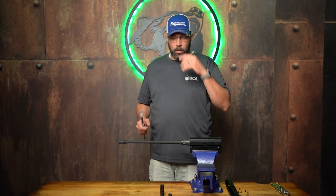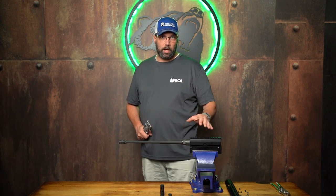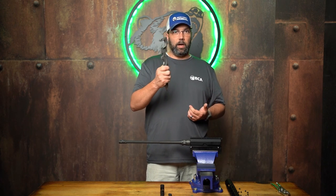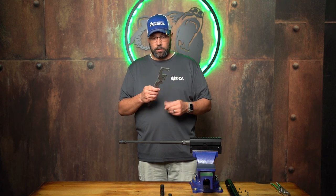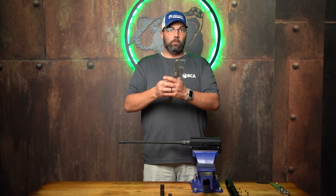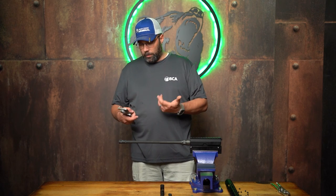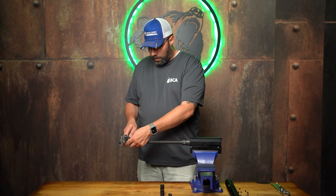You can see here I've exposed the barrel. This may look a little funny to some of you — this happens to be one of our 22LR uppers, so there's no gas block or gas tube because it's a direct blowback system. In front of me I have a variation of an armorer's wrench. There are a hundred of these on the market. Our flash hiders here at Bear Creek Arsenal use either a 19mm wrench or a 24mm wrench for the bigger 450 muzzle brakes. For this one, it's just a 19mm.